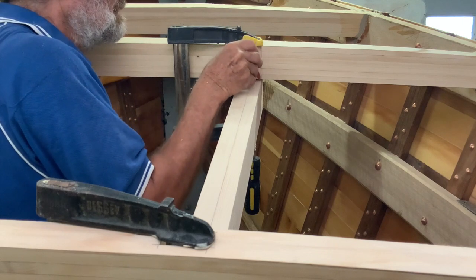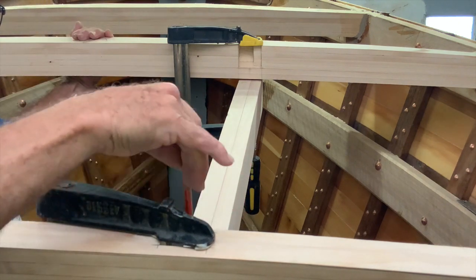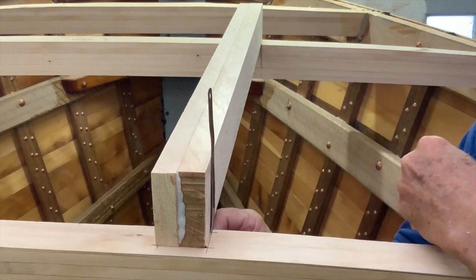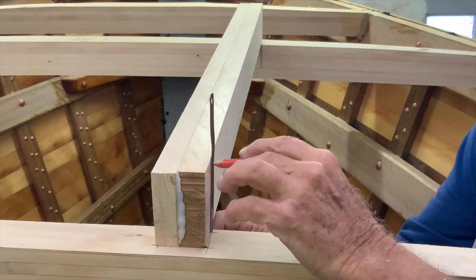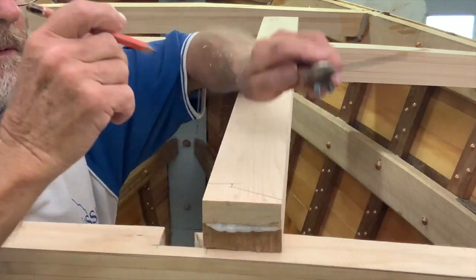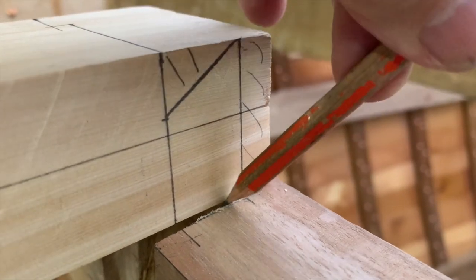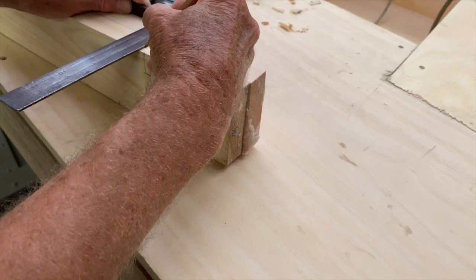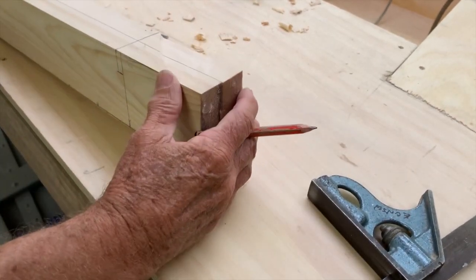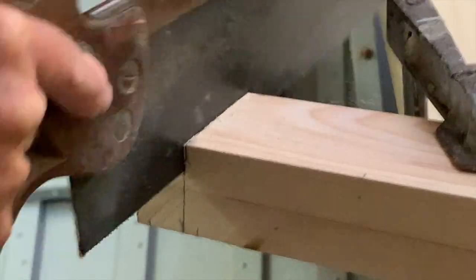The bottom of each carlin butts against both beams, so the first mark that you transfer is the distance between the bottom of the beams onto the underside of the carlin. Mark the angle of the slope of the dovetail onto the carlin and double-check every measurement. Because the carlins are square to the beams, every mark that needs transferring from one side to the other can simply be squared across. Like always, I start by cutting conservatively and adjusting the fit with trial fits.